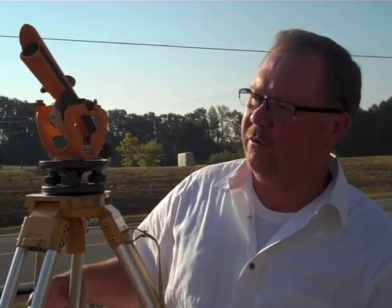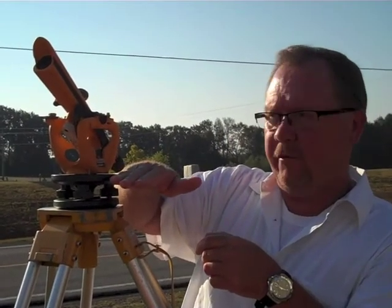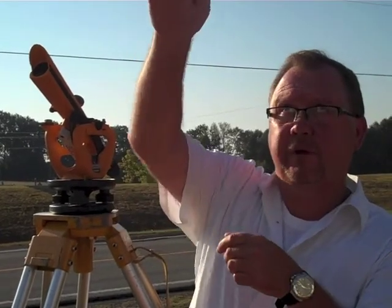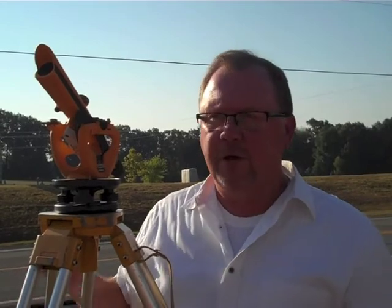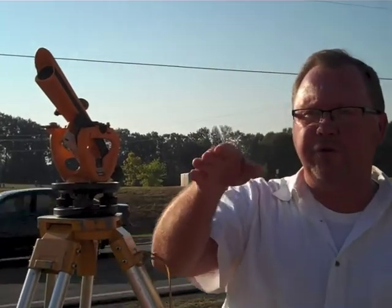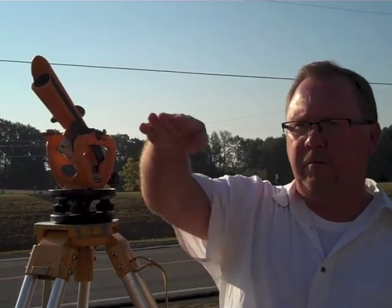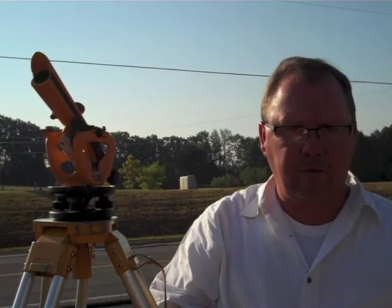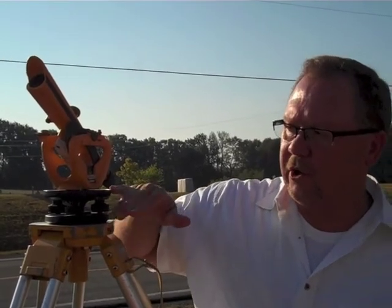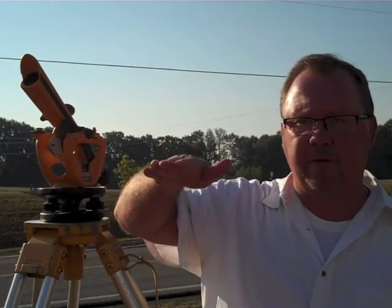At this point, we sight the instrument on the top of the tank, from this base level, and we measure the angle from level up to the intersection with the top of the tank, and our reading is 36 degrees. So knowing that we are 156 feet from the tank, that our measure down from level to the bottom of the tank is 11.4 feet, and knowing this angle of 36 degrees, we can now compute the height of the water tank from the bottom of the ground.